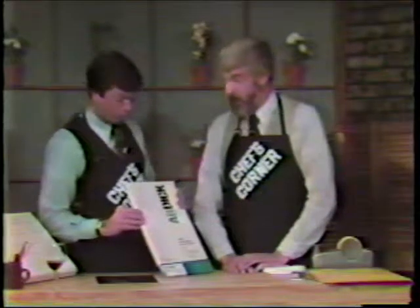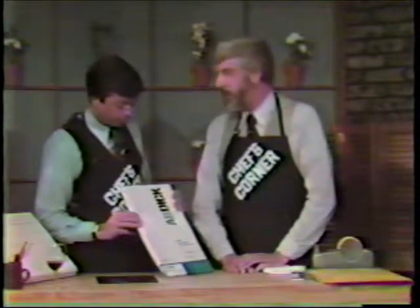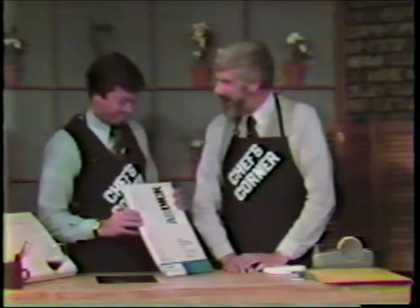Where do we start? Right down here in the corner, you see 2-7024. The number. What is it? 2-7000 series and 2-8000 series. Those are the two different kinds of plates. And the primary difference is, of course, length of run. Well, we can talk about it right now. The 7000 series has a guaranteed run length of 15,000 copies, and the 8000 series has a guaranteed run length of 25,000 copies.